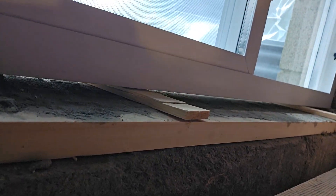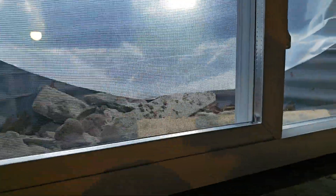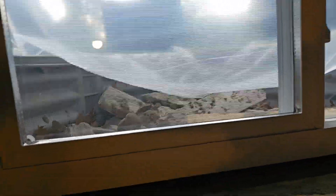It just doesn't make sense to save pennies and cheap out on hardware. So it's okay to screw your windows in place and then seal around them. Best of all, I can now remove these wooden shims, the window will stay exactly where it is, and I can seal all the way around it. I won't have to cut these off, and that will prevent an area where moisture penetration could happen and cause rot.